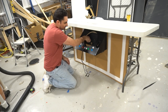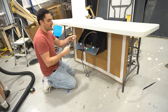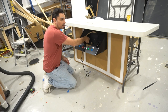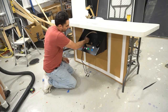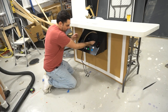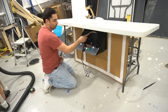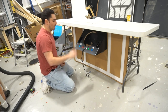So essentially what I'm doing right now is I'm taking this off. So technically the toggle bolt is gonna fall behind the wall, but in his situation, it's not. The only big thing is you do need a small screwdriver, or you know, if you have like the angle bit on a drill, you could easily do it. I wouldn't really put a drill to this, to be honest with you. I would take a very small screwdriver and just slowly go that way. Again, three toggle bolts, but I only have two. I didn't even put the middle in, and as you can see, it was supporting it. Let me take these screws out and we're gonna bring it up top here.